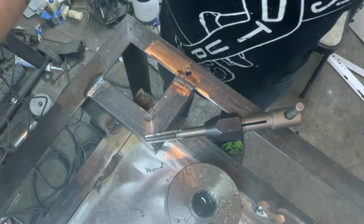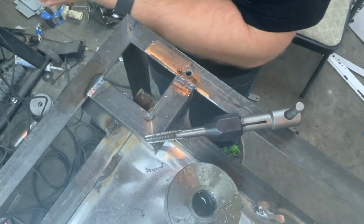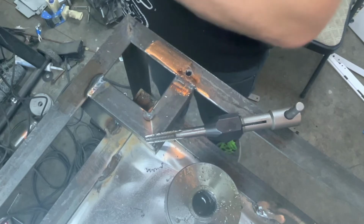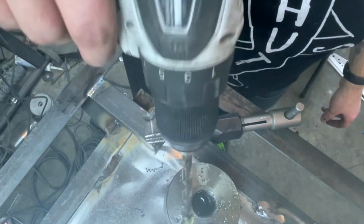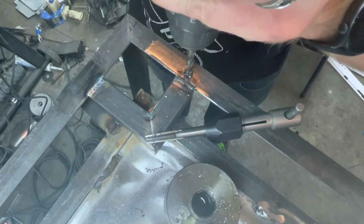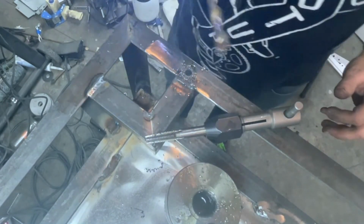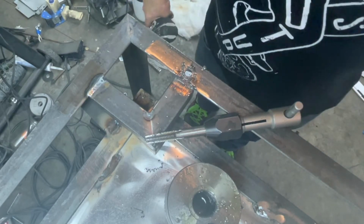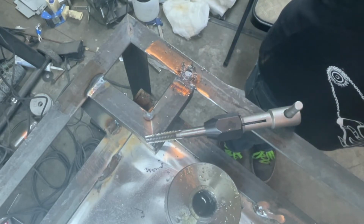So I have 3/8-16 bolts that I'm going to be using. That 16 just refers to the pitch of the threads. It's 1/16 of an inch between threads, or they're 16 to an inch. And the diameter is 3/8. This happens to be the tap drill, which thankfully is just a normal size. I have all the number tap drills and stuff, but it's a nice one. It's just 5/16. That's pretty easy.